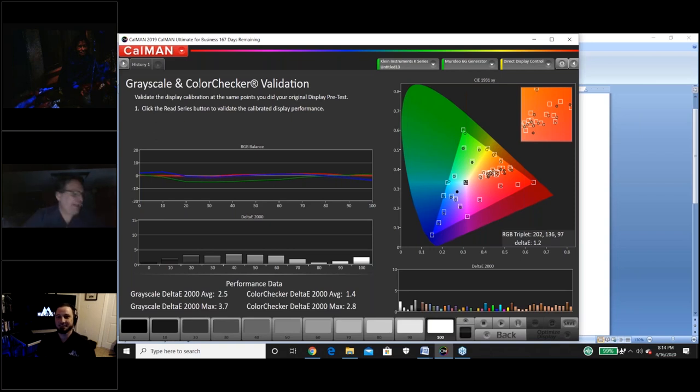So you can see a little bit of the image there. This is the Indian lady in the market off the Murideo generator. Great HDR pattern, but it's just way too dim on this projector the way it is. You notice it's still in the reference mode. I had set that up for our shooting at 70 nits, I believe, which is too dim. And at the same time, you see it defaults to gamma D.